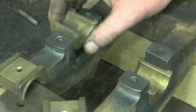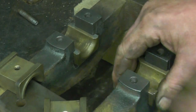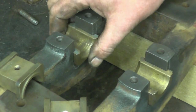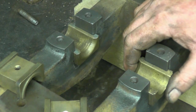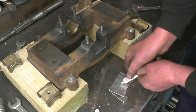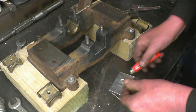Now what I'm going to do is put some Araldite around here, just so when that goes on — because the bearings won't be coming out again — it fills that little bit of movement there. This one's absolutely solid. I think the stuff I scraped out of there was some sort of sealer to locate the bearings into the casting. I can hear people say that they didn't have Araldite when they built that — it'll have been some sort of white lead mixed up — but I can assure you if they'd had this stuff they would have used it. No doubt.